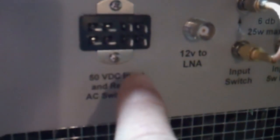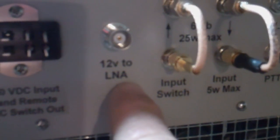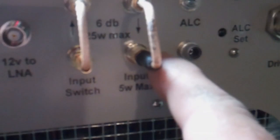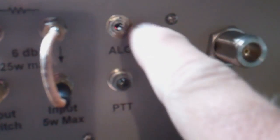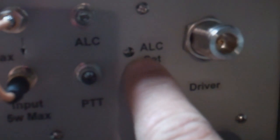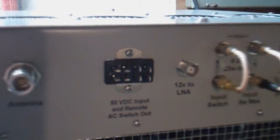It's got vents in the back and the fans. This is the back of the amp — you've got your antenna port. This is your 50-volt DC input Jones plug. You've got a 12-volt BNC connection for your LNA if you want to power it from there. There's the attenuator, which can be bypassed by switching the cables. You've got your PTT, your ALC connection, and ALC set adjustment screw. And then you've got your input or driver's side. You can see the four fans back here that kick in based on a temperature thermostat built into the unit.